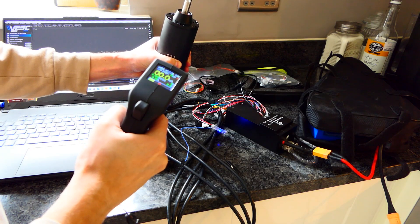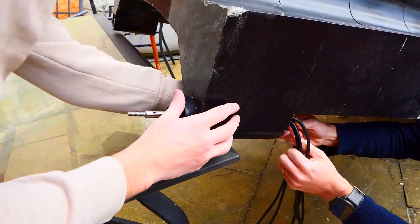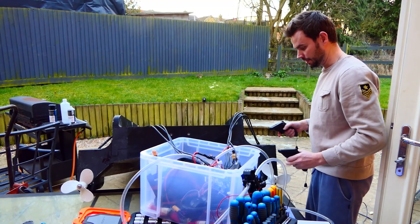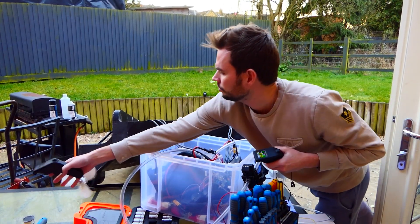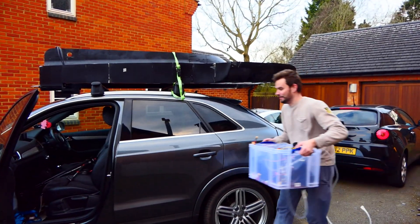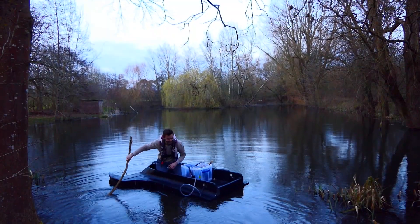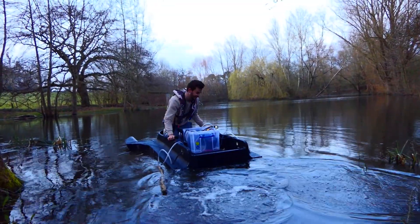For the powered boat, I'm using two 6kW 72V electric motors, which have plenty of power. I'm aiming for around the 30mph mark as a starting target. To transport it to the lake I had to use my friend's roof rack — it looked ridiculous. The plastic box holds the electronics: speed controller, battery, etc. I plan to incorporate them in a neater way in the future.